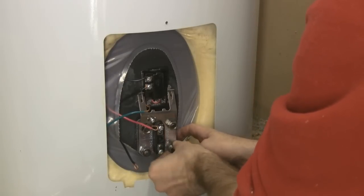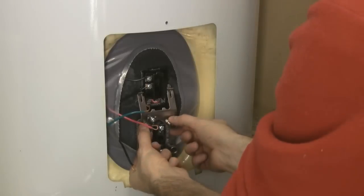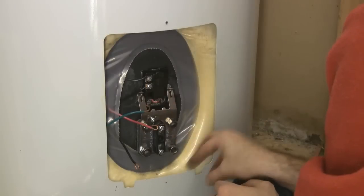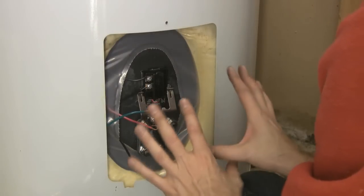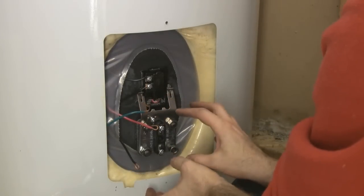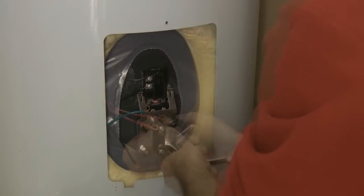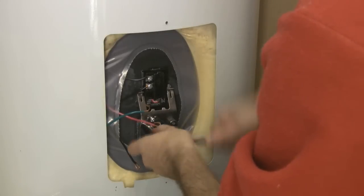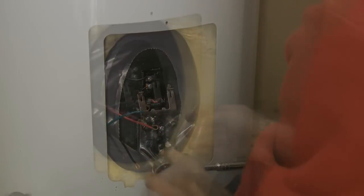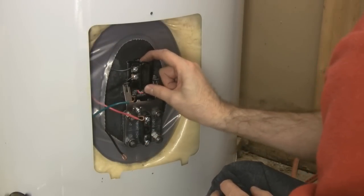Sometimes that happens and it makes it really tough to re-tighten these. As I put these nuts on and tighten them up, I'm going to alternate nuts and tighten them very gradually in a circle so that the plate is seated with even pressure. If you tighten one really tight and then try to do the others, you'll put the plate on an angle and can damage things in the system. Now all four nuts are tight. The temperature sensor is nice and snug to the tank — you've got to double check that.